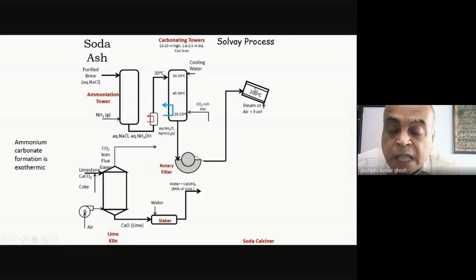So it gets scraped out so that you maintain a clean surface, so that you can have good heat transfer efficiency. Another way in which you can reduce the amount of this encrustation of sodium carbonate on the sides is that they found that because the cake is wet, there is a tendency for it to stick to the surfaces, and that tendency is more. But once I add some solid sodium carbonate, which is dry stuff, I mix some of the wet with the dry product, and because the overall thing becomes more free flowing, it has much less tendency to stick on the surface.